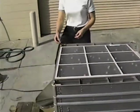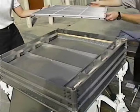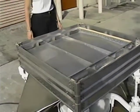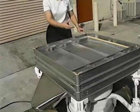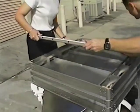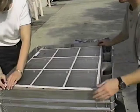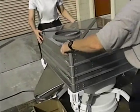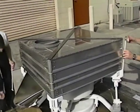The insert frames lift out very easily so you can change from one product to another. We've got stainless steel pans so that when the product goes through the screen, into the pan and right down into the hopper, you've got a nice, clean, easy sifter to maintain. To put the screens back in, all you do is slide the insert frame back in, put the cover back on, and the gaskets will seal around all four sides. We'll put the hold-down rods on it, tighten them down, and then we'll run some product through it.